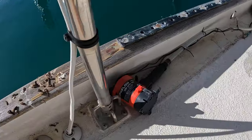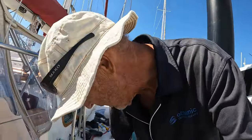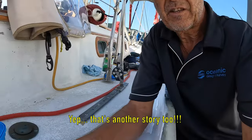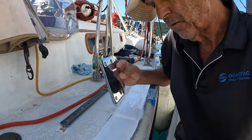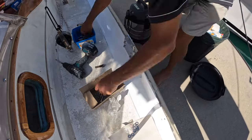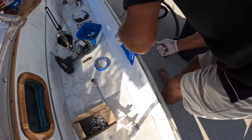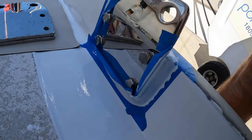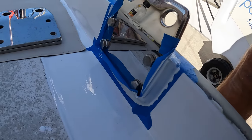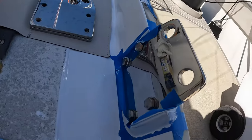One eternity later — good morning! Today we can start putting bits back. Here's the freshly painted white scupper. I've already dry-fitted these, so now I'm putting them on permanently. A good tip when applying Sikaflex sealant: mask up everywhere you don't want it to go. Then with a latex glove, just wipe your finger around to make a nice fillet, give it 10 minutes, and peel the tape off.